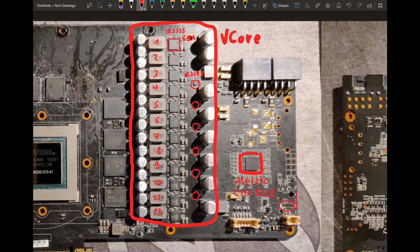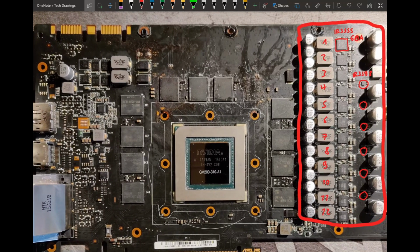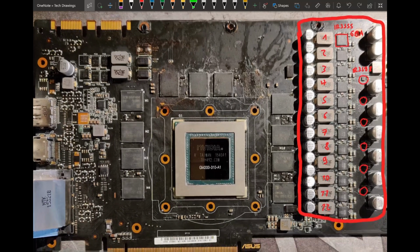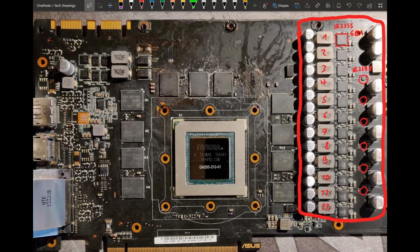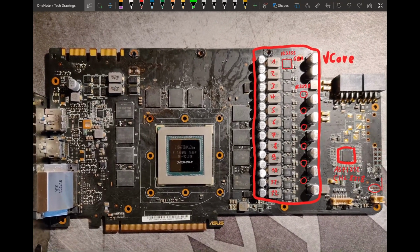Of course, this only controls vCore. You're still gonna, because on liquid nitrogen you probably also wanna tweak the memory, and then on liquid nitrogen you usually also tweak the PEX rail to get out of cold boot bug issues. But yeah, so as far as controlling vCore goes, this is a very nice card. It's a VRM that can handle a lot, and it's also a VRM that's very conveniently set up for you to just hook into.